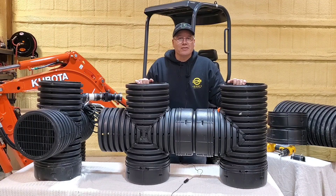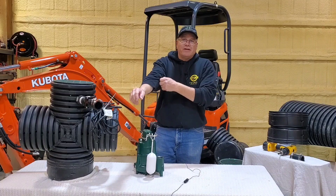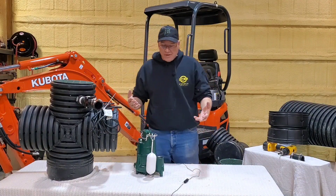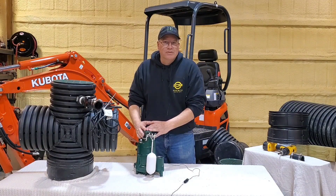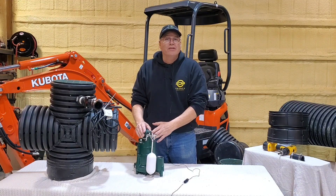What's going to happen during really big rain events — when you need it the most — is when you're going to run into trouble. The very best pumps will overheat and throw a thermo switch. This is so that you don't burn up your pump.